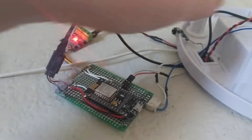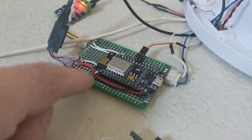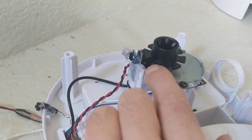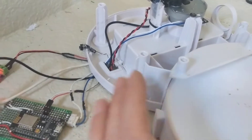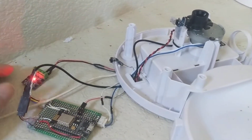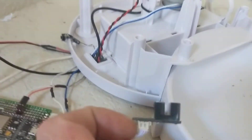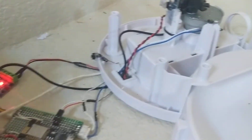It's a three-wire connection for the sensor going through this black cable. One wire is an analog signal giving a number between 0 and 1024 — zero is when it's closed, 1024 when it's open in the gap. As it moves out of the closed position, the number doesn't immediately flip; it's kind of a scale, but it jumps quickly. The three-wire version has some circuitry on it — an LED to indicate open or closed state and other things to help clean up the signal. I was getting amazingly better readings after I switched off the stock sensor. The stock sensor was great, I just didn't want to build the extra circuitry.